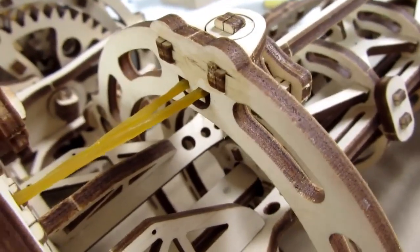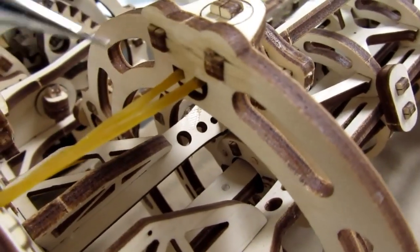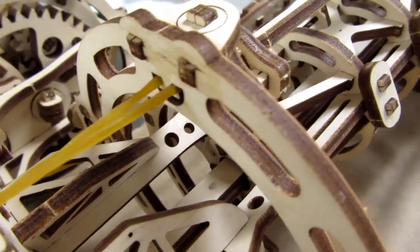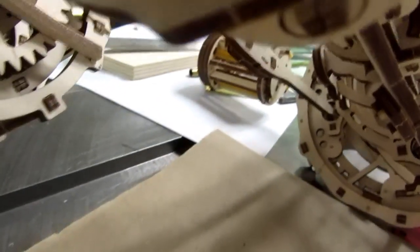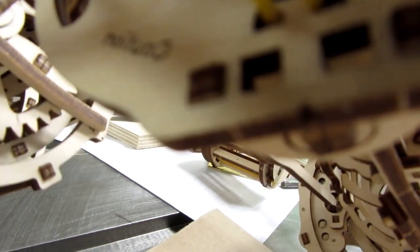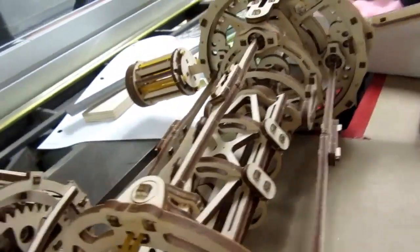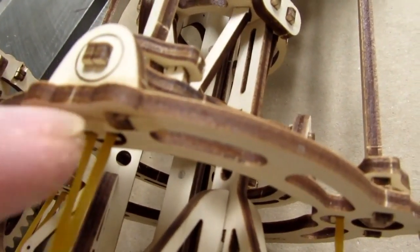Well, I was wondering if there was going to be some sort of a gotcha from having that part of the tower reverse that I mentioned earlier. This pivot pillow block piece here anchors into here, and its mate on the other side is wider and also has these two mounting holes here and here, into which snap these pieces. Well, the way it got assembled backwards, I think everything else is pretty symmetrical, but these guys don't have anywhere to go on this side, and these tabs here are too close together.